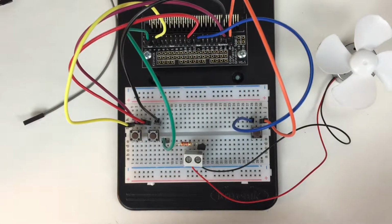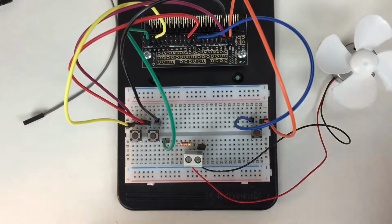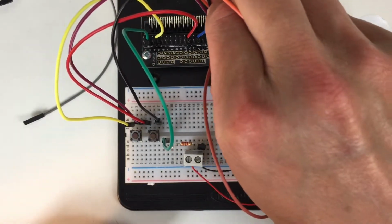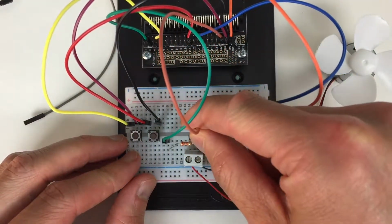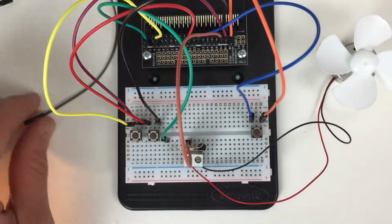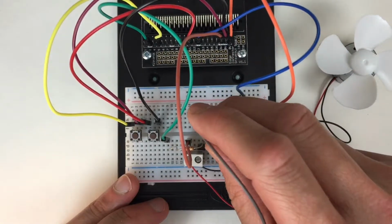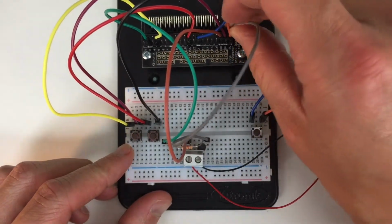And we are next going to connect up the 3 volts, I think you can see that here. So this is actually going to be doing the powering of the fan. We're going to connect that up to the same column. It's getting a bit crowded in here. Let's push some stuff out of the way. This is going to the same column as the left hand side of the terminal. So there we go. So that is going into the left hand side of the terminal. That's in the same columns. That will now be connected to the circuit. And we obviously have to ground this. So this is actually going into the same column as the right hand side, or the right leg of the transistor, and we're going to ground it into our final grounding space in the pins up here.